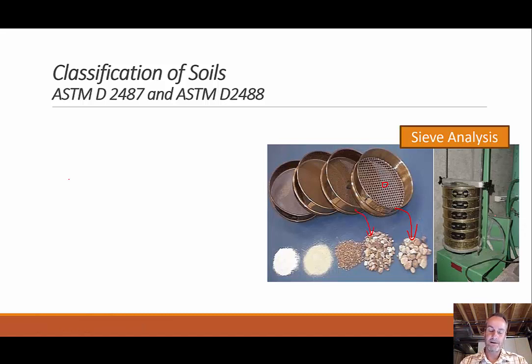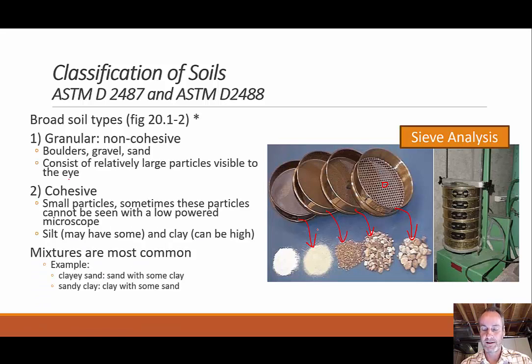After the soil is filtered, you can empty out each sieve and see your percentage. Those bigger rocks stay in the wider-screen sieve; anything smaller passes through to the next one, and so on. That gives you the idea of how the sieve analysis works — you can then measure and say what percentage is greater than, say, the number seven sieve. What we can determine is whether we're going to categorize the soil as granular, which is more like boulders and larger particles, versus cohesive, which is very small particles like clay or silt.